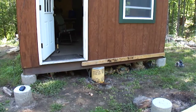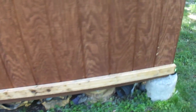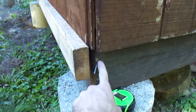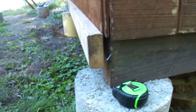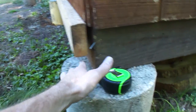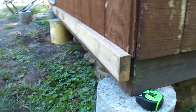Hey, why is there a 2x4 screwed into the bottom of the cabin? Well, let me tell you. So when I initially built this and wasn't really planning on a porch, I had the plywood overlap a bit, so it overlaps the floor joist. And now that I want to put another 2x8 right in front of this one, I need to cut back the plywood. So the 2x4 is there as my guide for the saw.